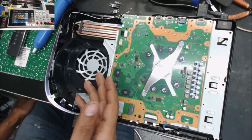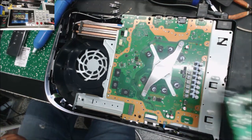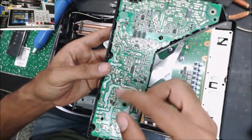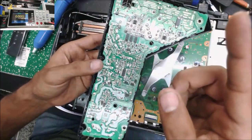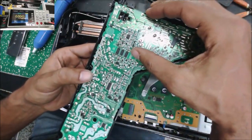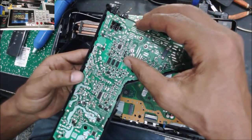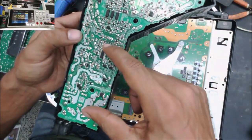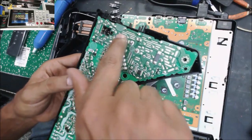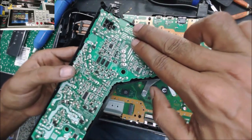And the problem is there is no replacement part available. Other thing that you can do, you can buy a regular power supply. If you have the hot side problem, you can buy another power supply, carry over from here, and use your cold side with the hot side of the new one, because what you need is this connector to be here, to be like that one.